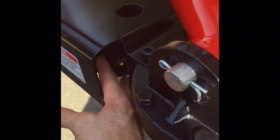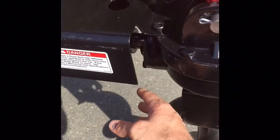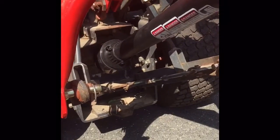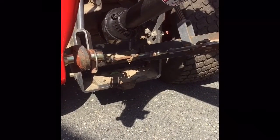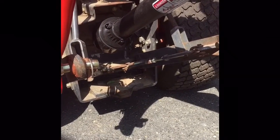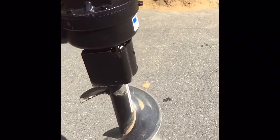From there, they want you to install the drive shaft — attach it to the auger first. Again, it's good to have a set of hands because it's kind of hard to see down in here. If you look through you can see this bolt; the idea is to get that hole lined up so you can slide that bolt in from the top and put the nut on it. From there, you attach the drive shaft to the power takeoff — it's a spring-loaded sleeve. You pull it back, feel your way onto it, then release it and it couples on.